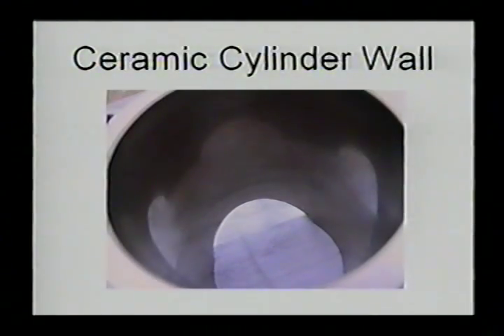We use a nickel-silicon alloy impregnated cylinder wall — it's an aluminum cylinder. It's very lightweight and transfers heat very rapidly. The cylinder is air-cooled while the head is water-cooled, which gives us some redundancy. In the case you lose your coolant for some reason, you do have some cooling on the cylinders and can continue at a reduced power setting.